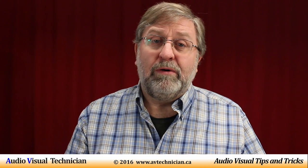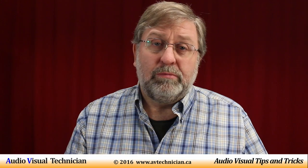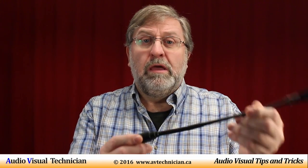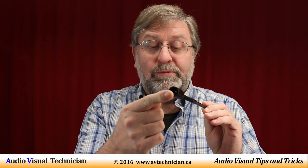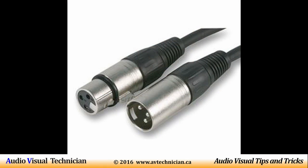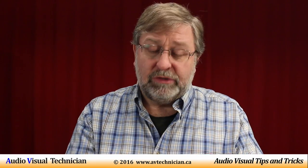If you're going to connect a microphone to your mixer board using something like this — a microphone that connects up using the XLR connection, or likewise a microphone like this that hooks up again with the XLR connection — these kinds of microphones wish and desire to have a little bit of extra juice in the form of phantom power provided by your mixer.